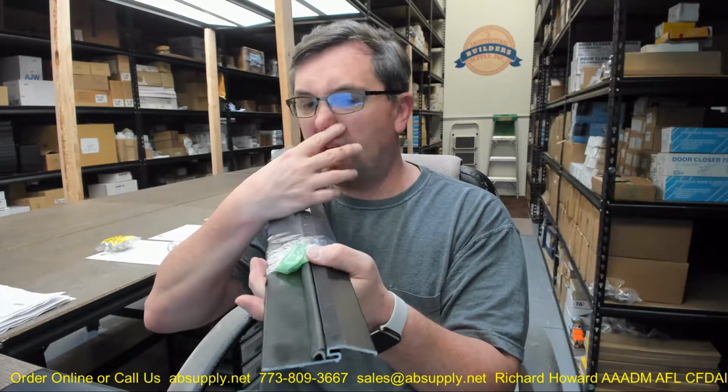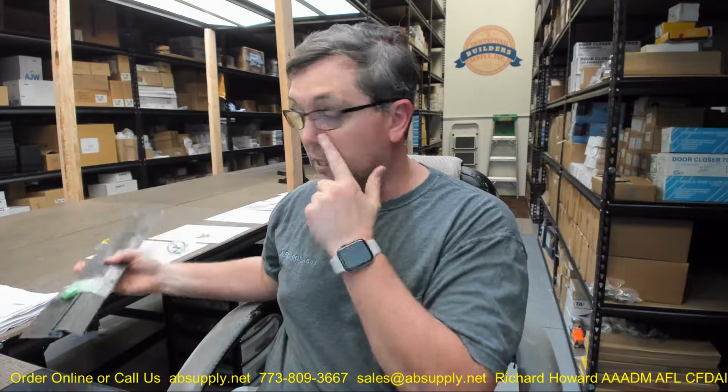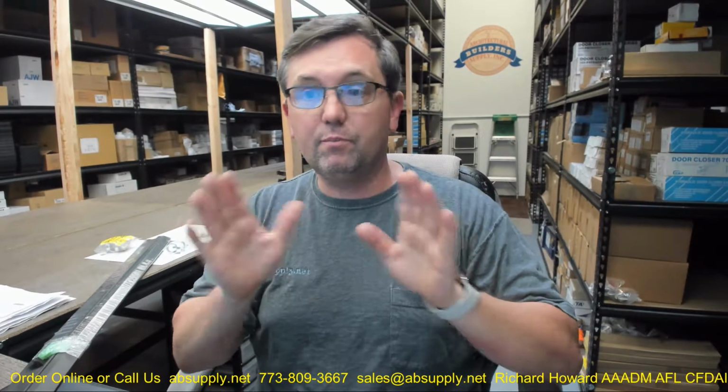But that's why they're using that terminology, because it is called out to act that way, even though I think this would not be what I would use if I had a surface vertical rod exit device like you would have in a 100,000 square foot big box hardware store. They've got pairs of doors on the back wall for emergency exit. Those will have pairs of surface vertical rod exit devices, but I would probably put a latch track threshold or a panic threshold on there that's known to be compatible. I don't think this one is. I think they're using the term because it's generically a similar sort of design. I would be using this in probably a residential application where I had an in-swing or an outswing door.